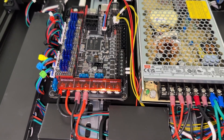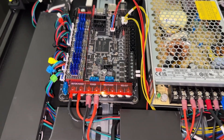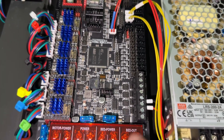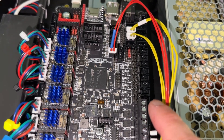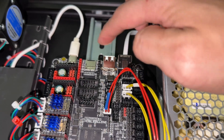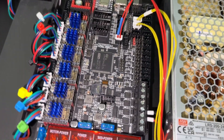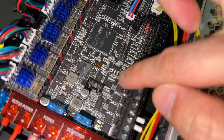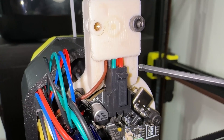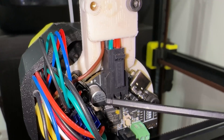It's hard to identify a root cause when it's working intermittently. The twelfth video was setting up CAN bus, and the biggest mistake is not having a backup plan when flashing firmware. Bad firmware flashes can break your board. CAN bus is relatively new to the Voron community and documentation is lacking compared to the main build. Worse, you may find conflicting information. A while ago, poor documentation on wiring the EBB-36 connector caused some people to reverse polarity and blow the capacitors.